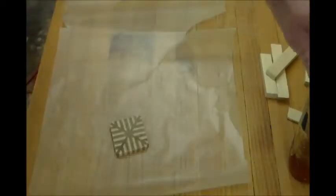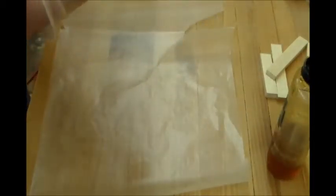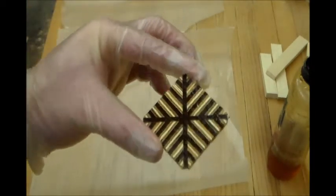There you have it. After a little light sanding, I like to put a coat of oil on these — I use tung oil. You could use mineral oil or boiled linseed oil. It just kind of helps pop the grain in the plywood and darkens the masonite a little too, to give it good contrast. You can see now how the layers of the plywood really pop.